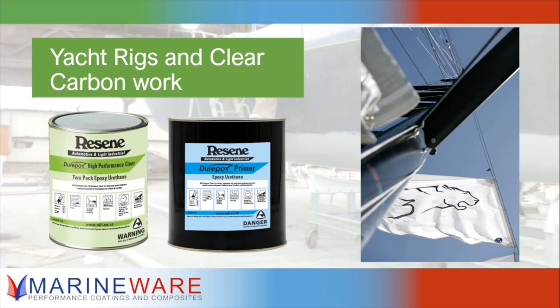I used to use a trick for pinholey carbon — I'd roller coat with slow thinners and accelerator, because the roller pushes the paint into the pinholes nicely. Because it's such a fast product the roller wouldn't leave a great finish, but if you rolled it on and then sprayed a coat literally five minutes later it would help even out the finish while having pushed the paint into the pinholes, which the spray gun alone wouldn't do.